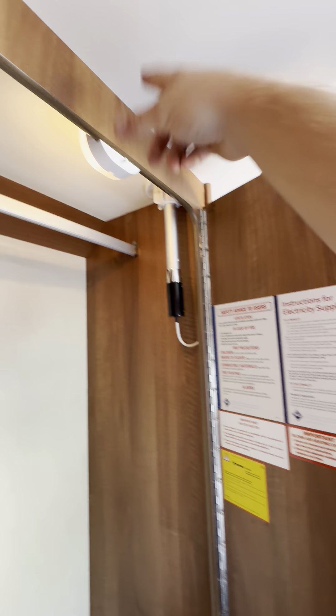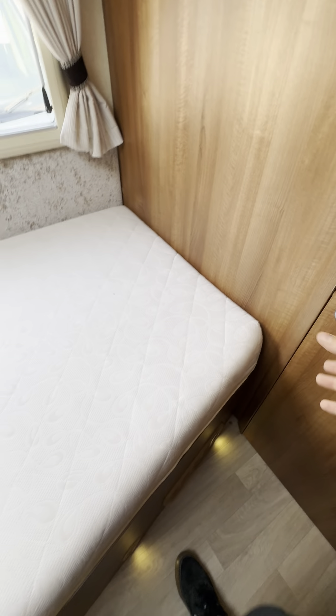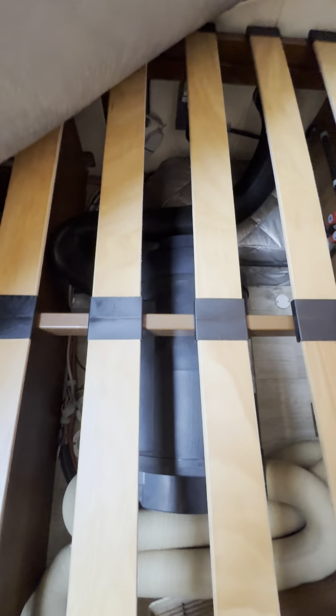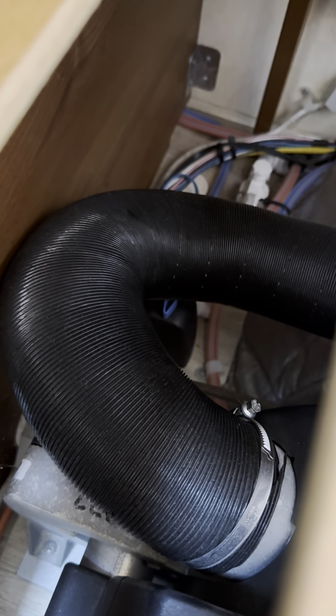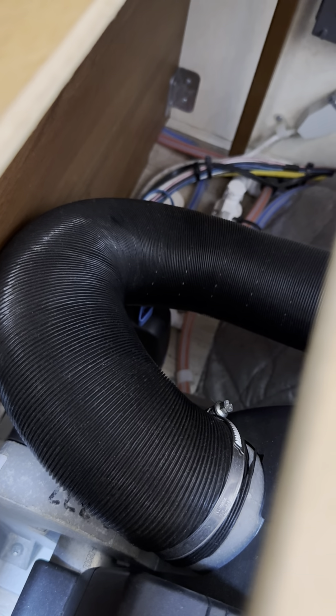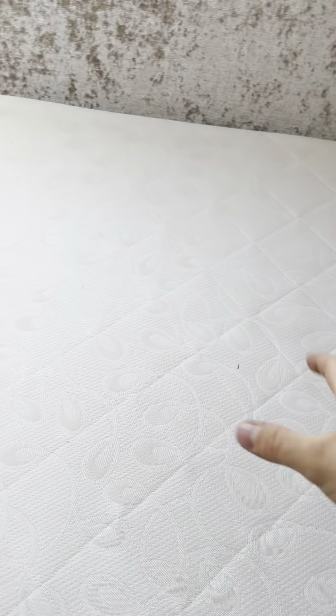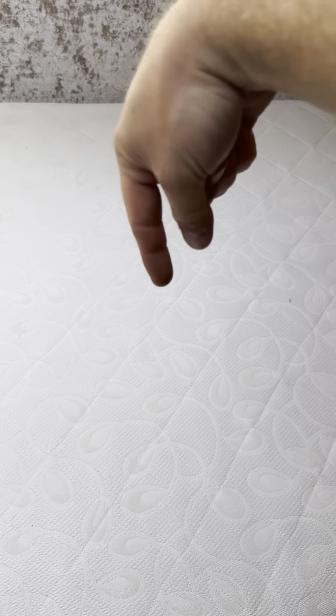The lights turn on and off as you open and close these doors. You've got access to lifting up this bed if you want — essentially if you needed to get access to the boiler, you can do that just from here. There will be a drain for the boiler as well, just over there — the thing with the blue top. If you ever need to close off that boiler drain, which will open up by itself when it gets really cold outside, twist it back to where it is now and push the little blue button back in on the left hand side. That's how you stop the water from draining out from the boiler.